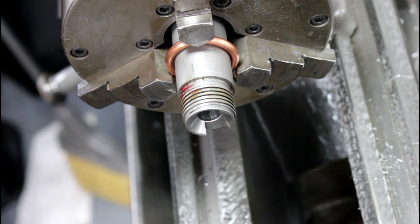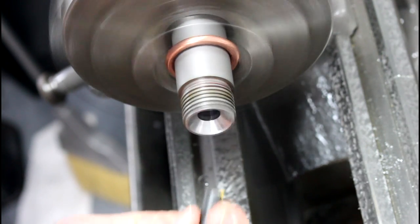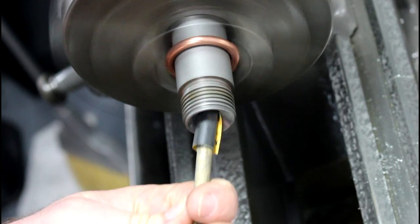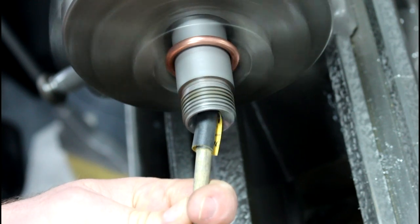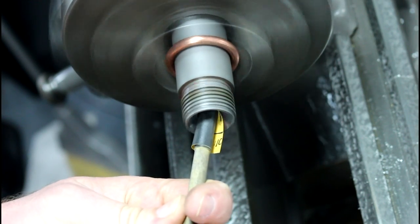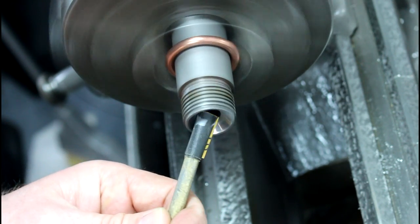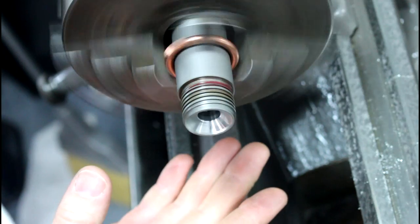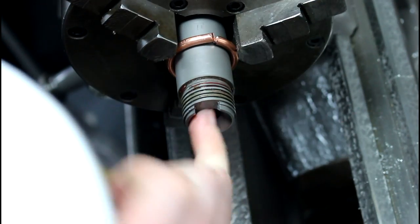Because this is where, on a lot of custom barrels, if people don't knock this edge off, you'll get scratches in your cases. And then people wonder where it's from. So the only part of this I'm touching is where the cone starts, between the cone and the chamber, just on that edge. I could come out here and do this, but it's kind of tough with that extractor cut there now. As you can see, it'll rip your paper up. So let's look at that. And you can feel in there, you just want to break the edge.